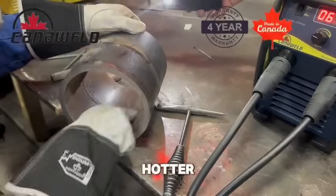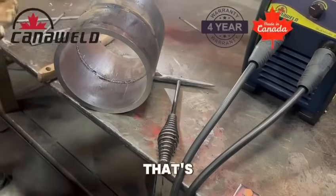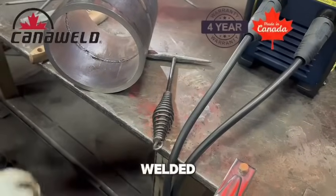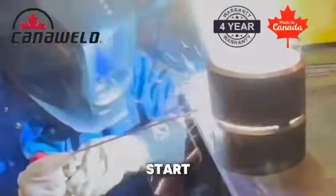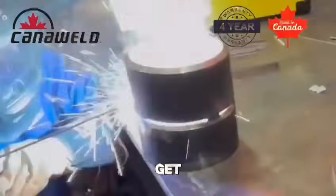Obviously when I was a bit hotter like this, this is gonna be your ideal with a bit of a surface, but that's at like 65. Like 60 — I've never used these rods at 60. They don't even heat up at 60. You're just gonna start and they're gonna stick. You're gonna lose your flux on your electrode. They're gonna get stuck.